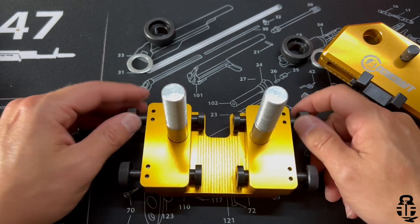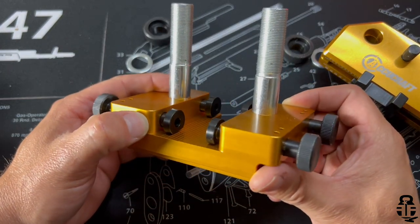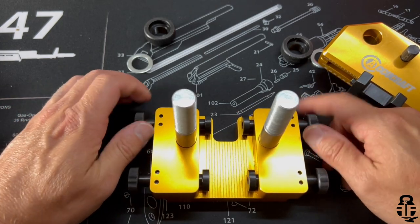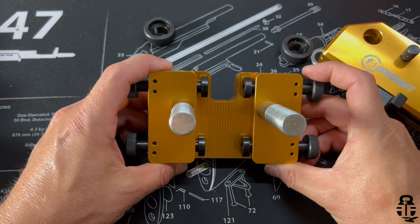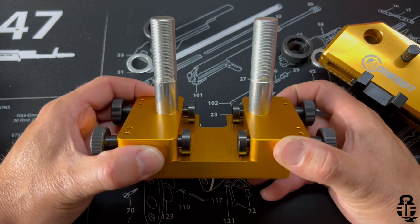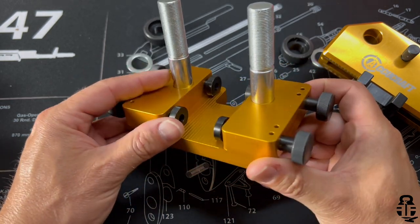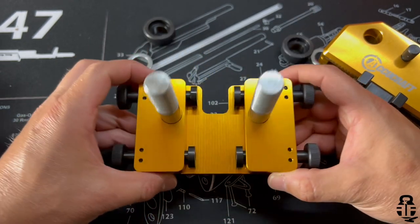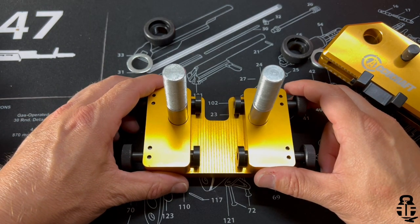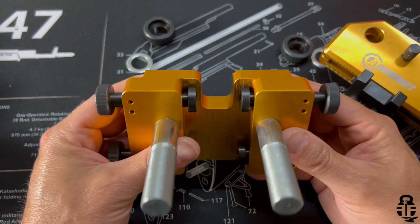You can just take those two nuts off and that separates the top from the bottom piece. The bottom piece is constructed in a way that makes things extremely easy — everything about this tool is very intuitive. You have locking collars on the base that pinch your slide into position, and the top piece vices down on top as well. There are lines engraved into the base to help ensure your slide is perfectly perpendicular, because if you push sights with your slide canted, it could really damage things.